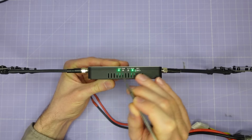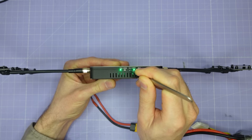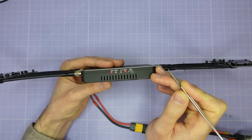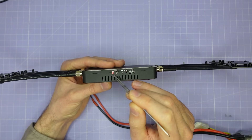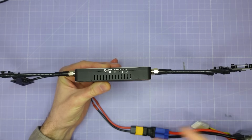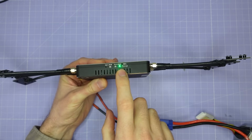Once you've got the image on the drive, unplug the USB and reboot the repeater to apply the firmware update. Hold down the bind VTX button just as you would for the goggles or FPV drone unit, and the whole system will reset and apply the firmware update — just keep holding until the whole thing reboots and you see a first flash of the red light. The firmware update is being applied while everything flashes red, and in a little while these will go back to flashing green. Once the bind VTX and bind VRX lights stop flashing red, just power cycle the repeater. When it powers back up, both lights should flash green — that means the firmware update has been successfully completed.